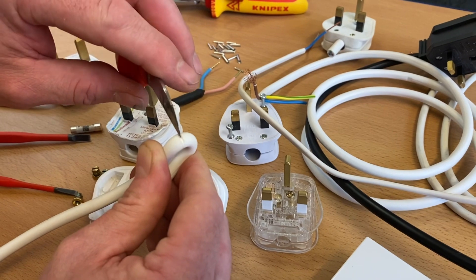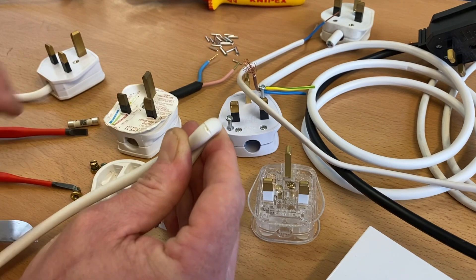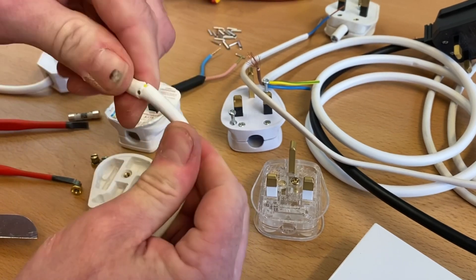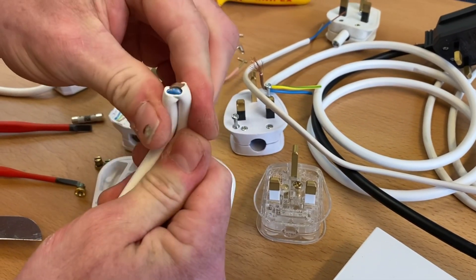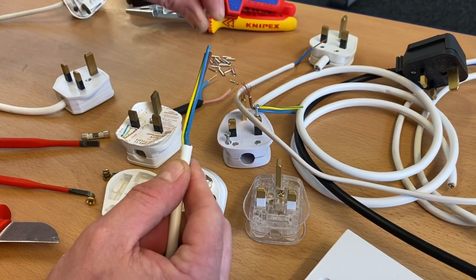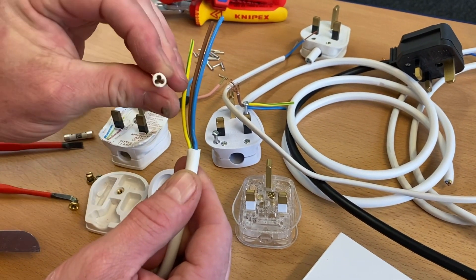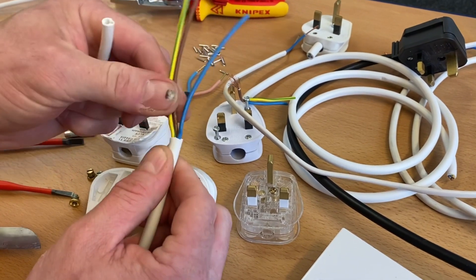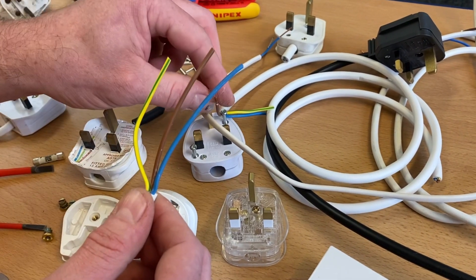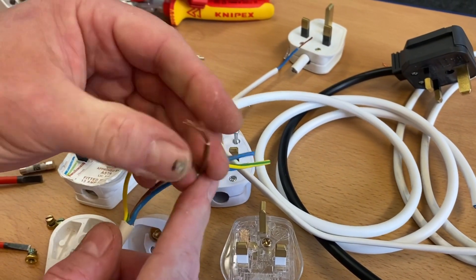Students will press too hard and potentially damage the inner PVC, so press gently. With just a few burst holes the outer sheath pulls off really easily. The white powder you see inside is French chalk - it stops the inner PVC sticking to the outer sheath. The outer sheath's been removed and we've now got our inner PVC covering our class five conductors - fine stranded copper, which makes sense because this is a flexible cable.